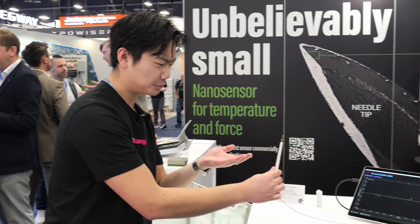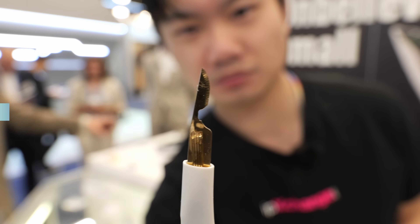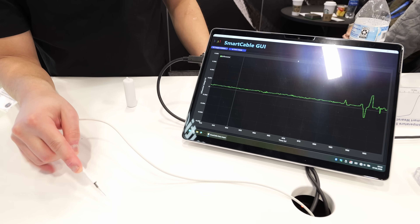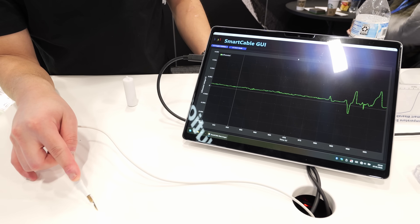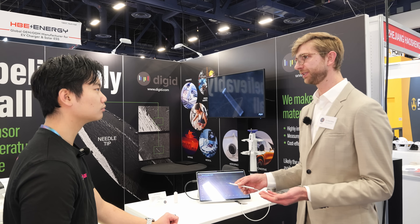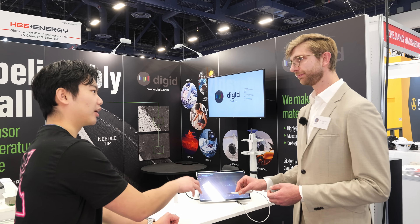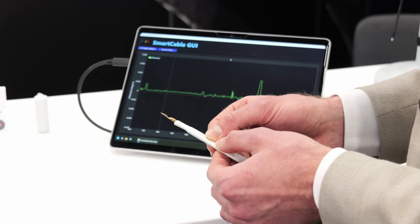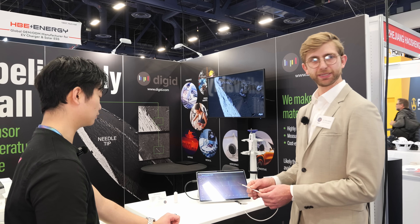Walter, you have what appears to be a regular surgeon's scalpel blade — what is this about? Well, this is actually a regular scalpel blade which we hooked up with some strain sensors, so now it's a smart scalpel. As you can see, we can measure the cutting forces as we press on the scalpel. It looks and feels the same to the surgeon, but we get the full information about all the processes during the surgery. We printed the sensor directly on the blade — did some metalization of the scalpel, printed the sensor, and hooked it up to the electronics.